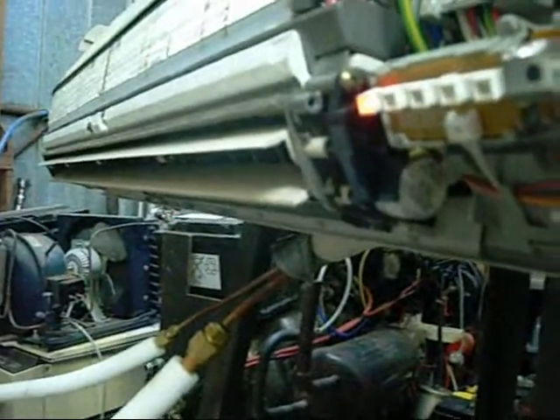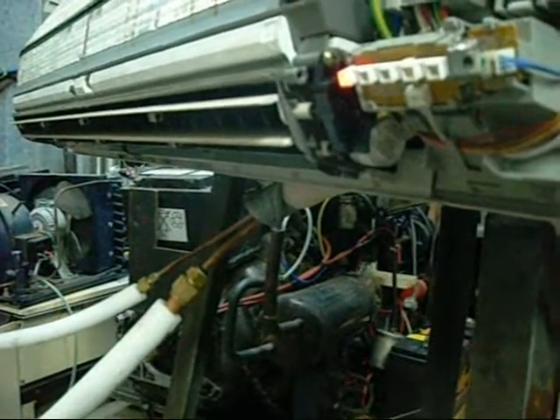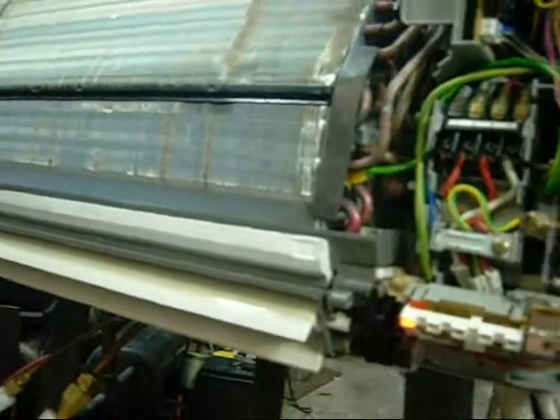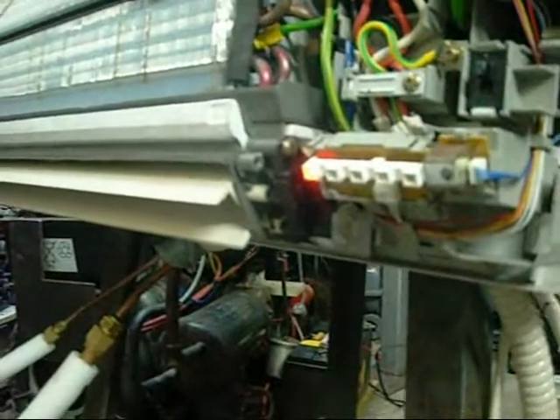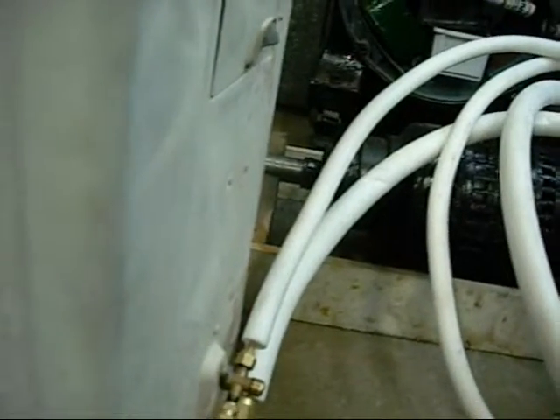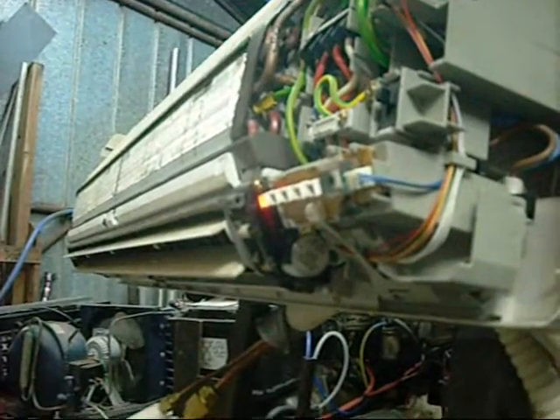It's going through its little air diffusion cycle — not a bad thing. I think the stepping mode is a bit out of whack because it was half open when I found it. It obviously turned it off whilst it was running, which is quite normal for pump-down. You run it in cool mode until it pumps itself down, leave the liquid line shut, wait until it comes down to vacuum or almost vacuum on the pressure gauge, and then shut the suction line and cut the power off immediately. That's how you can pump them down. I think that's what they did with this one. Right now I think it thinks it's going through a cooling cycle — not a bad thing.